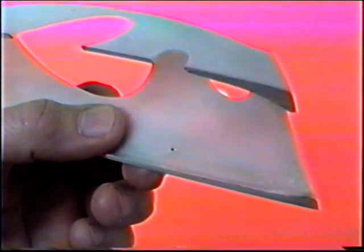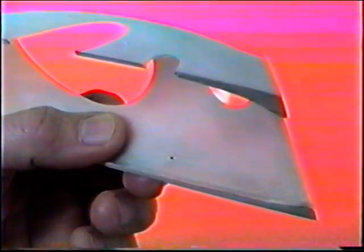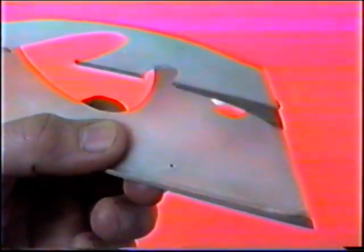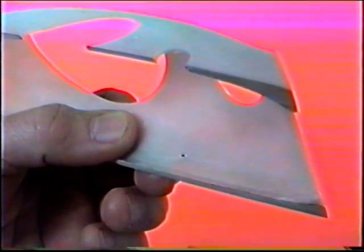Whenever you're drilling through fiberglass, or in this case real wood, it's good to run the drill at a real low speed, rather than having it catch and go right through and usually make a ratty hole that way. It perfectly transposes right over.